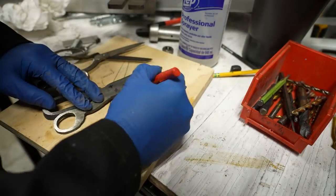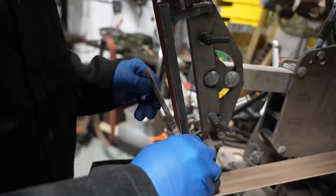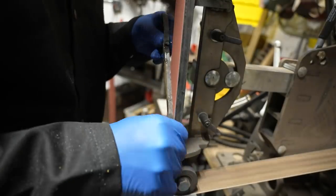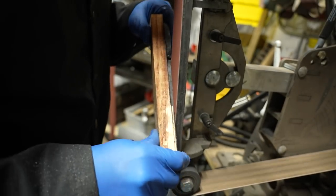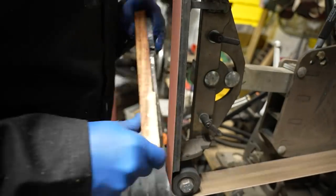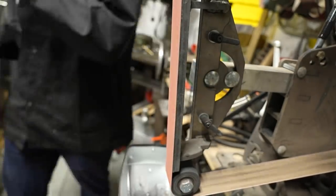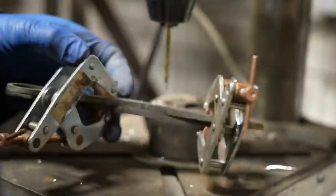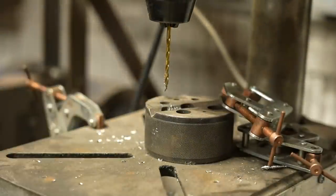Now that the pieces are pretty much flat, I can sort of visualize where the blades are going to be. On the scissors I'm modeling these off, the single hole blade is more pointy while the other side is a little more broad. I don't really know anything about the way scissors are supposed to be made, so I'm just guessing. One of the things I did notice is that both sides of the scissor have a shoulder in them, and that shoulder is what stops the blades from going too far. So right now I'm grinding in that shoulder using the belt grinder — that's just going to allow these things to stop when they're closed. Then I use little clamps to hold them together, and I use a drill bit to drill an eighth inch hole through both pieces, which is going to allow me to put a pin in there so that I can start mocking things up.